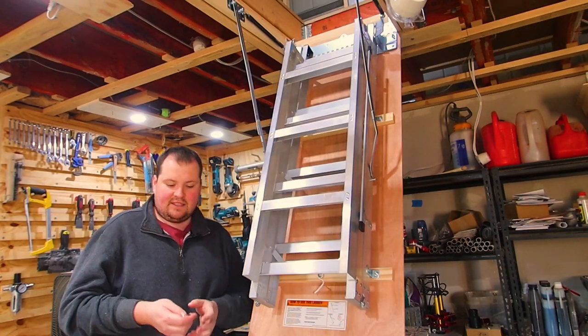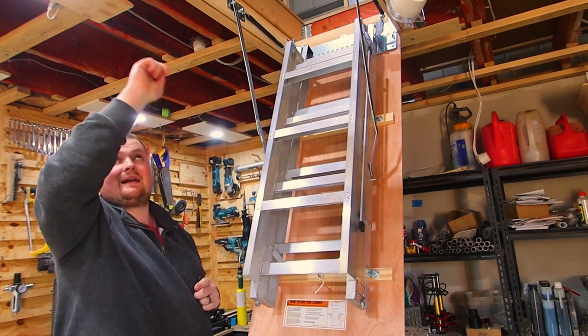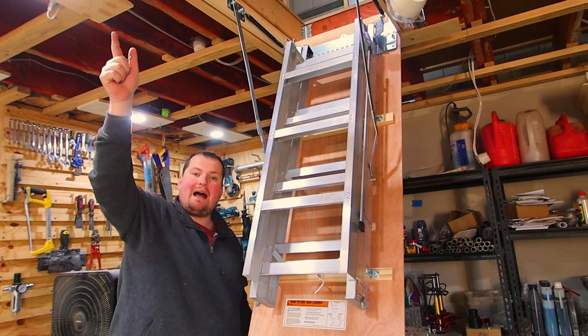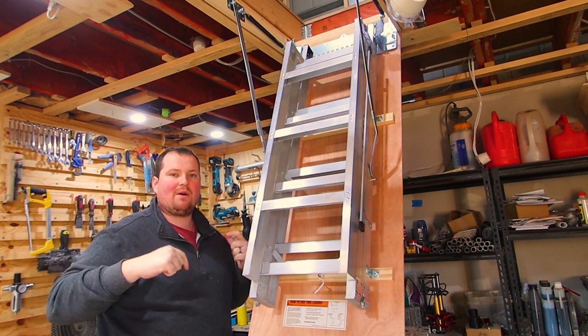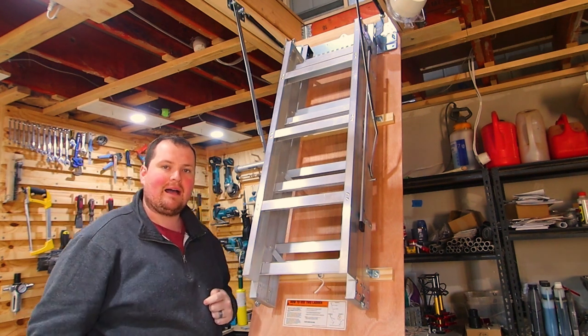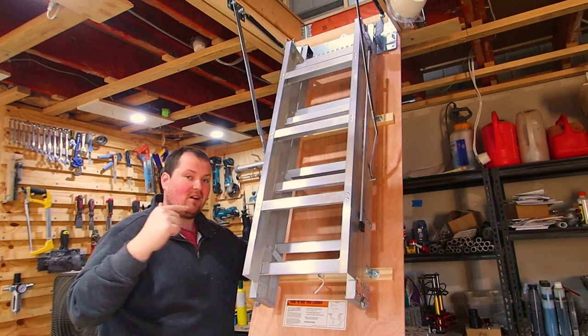Now that you've got that down, you're just going to grab a couple of decking screws or chipboard screws and just put two screws in the top where it hinges from, and two screws at the back. With the top edge, you don't want a gap. You want to have that as tight into your trimmers as possible, because that's where all of the load's going to be. And then we'll evenly space all our gaps around the perimeter. But at the hinge end, no gap, as tight as possible.